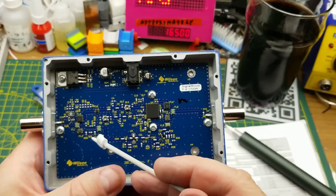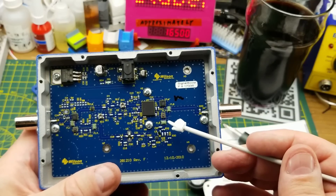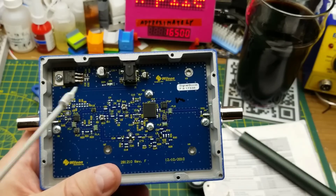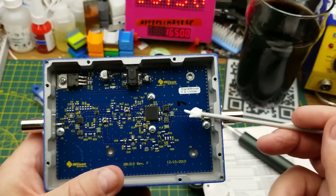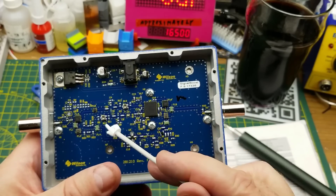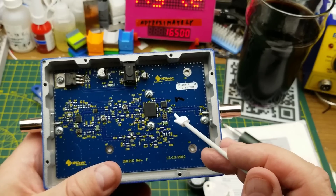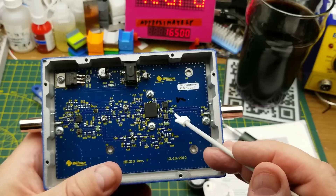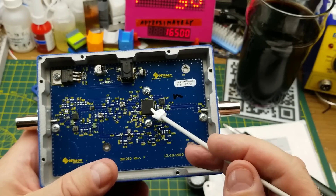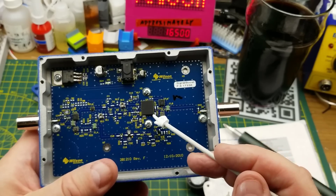The different filters are separating the 1900 MHz and 850 MHz frequencies and splitting them into uplink and downlink bands, so you essentially have four RF paths — two going in each direction at the different frequencies. I'm assuming the main chip is just controlling the gain. As I said, this doesn't demodulate the signals at all; it's strictly a raw RF amplifier in two different directions. That chip is probably measuring amplitudes and adjusting gains.